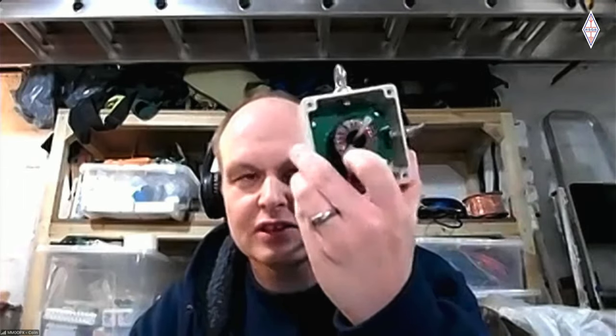I think we would need to go with something else, and that is the problem with end-fed half-waves for running QRO, running high power. There isn't a core like this 1002 core, which is great and nice and efficient right across HF. There doesn't seem to be a core existing for the same for running higher power. Obviously, us as radio amateurs are relying on commercially available cores.